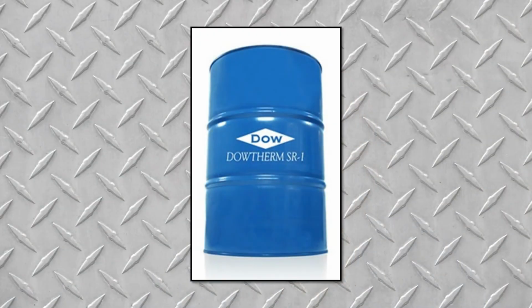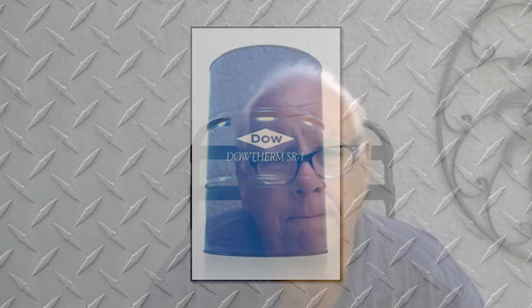In a lot of cases, what we're going to see is that intermediate mediums are used. Pictured here is something called Dowtherm, which is a heat transfer liquid and is often used as an intermediate medium because of a high boiling point. What you can do is use it as a liquid, heat it up in the stack, and then take it to preheat your combustion air or whatever else you're going to do with it. So a gas-to-gas heat exchanger is not required.